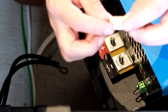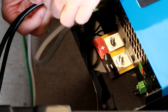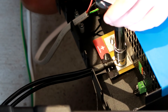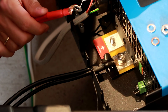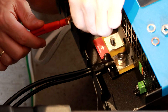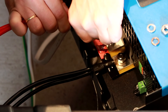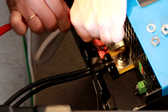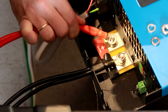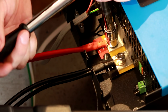Again we are using a 22 ohm, 5 watt resistor to pre-charge the capacitors of the inverter, so we are going to connect the negative first. Then we connect the positive terminal via the resistor to the positive terminal of the inverter and let the resistor pre-charge. We can hear the click inside the inverter, the lights are coming on on the display, and I think we are pre-charged enough to connect right now. No spark this time!